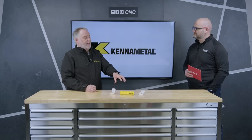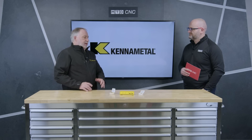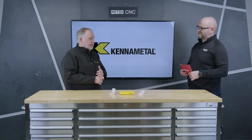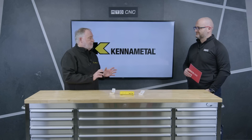The KBH10B and KBH20B grades are more aimed at hardened steels. For people who haven't used it before, typically what components do we see machined using these? A lot of it is aimed at gear and shaft manufacturing — gears, some pulleys as well, but mainly that sort of market. Anything to do with gearboxes, shafts for off-road machines — anything that has a hard surface that needs to maintain a tight tolerance and accurate surface finish, where tolerances are in microns.